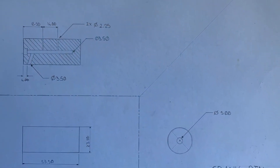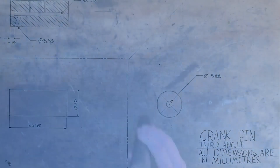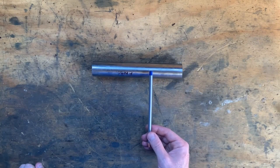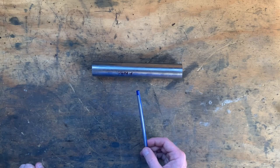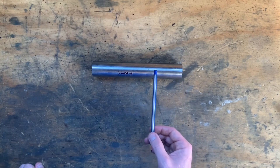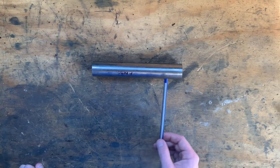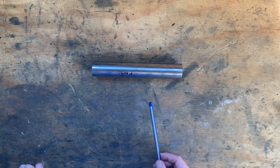It's been about 11 years since I've had to put pen to paper to carry out any drawing, so we're going to make it work. There are a few considerations: we have to leave 25 mils on the end to grab it with the driving dog, it needs center holes on both ends which I want removed at the end, it also needs to be drilled through from one side with two holes for oil feed to the big ends and one oil feed hole to the main internal gallery. Other than that, I'll just do the lathe work for now — turning down the diameter and placing the center holes.